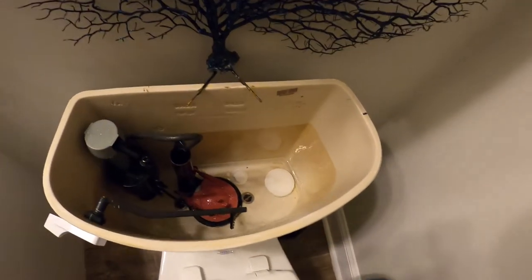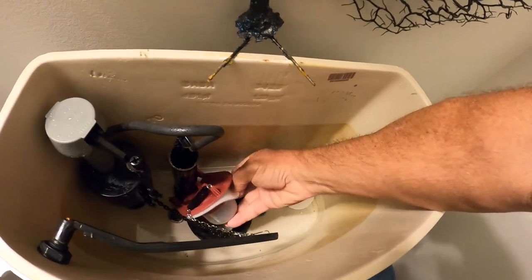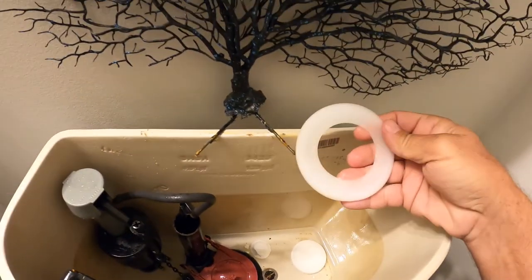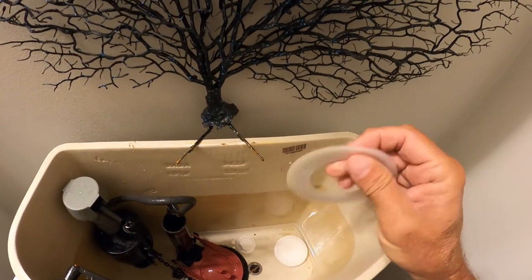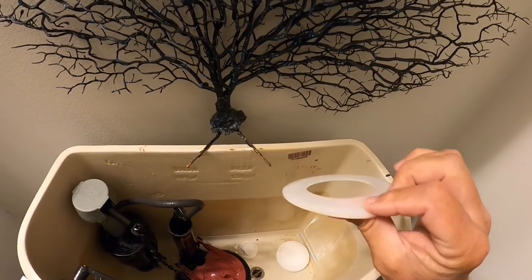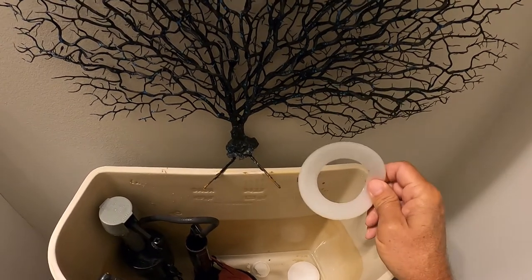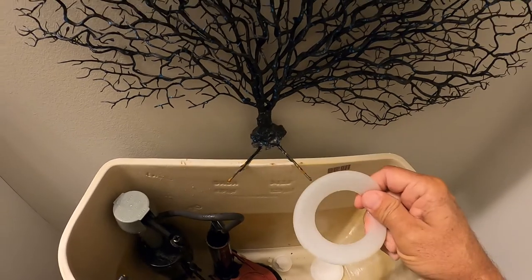For a running toilet — one that just keeps running throughout the night and leaks — there's a seal right on your plunger. You can take that off just like that. On the seal, you want to check and make sure it's nice and flat. On this one a while back there was like a little bubble, almost like a pimple. What I did is I just went ahead and popped that with my finger, because they sometimes get like a little blister in these seals. So check that to make sure it's nice and flat. If you've got a bump on it, just squeeze that bump and let it go flat again. This could be one of the main reasons why your toilet keeps leaking — it doesn't seat all the way when you lay it down.